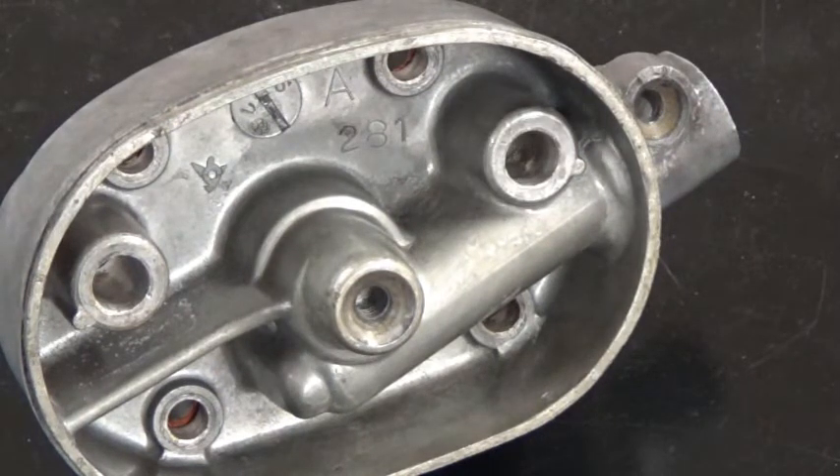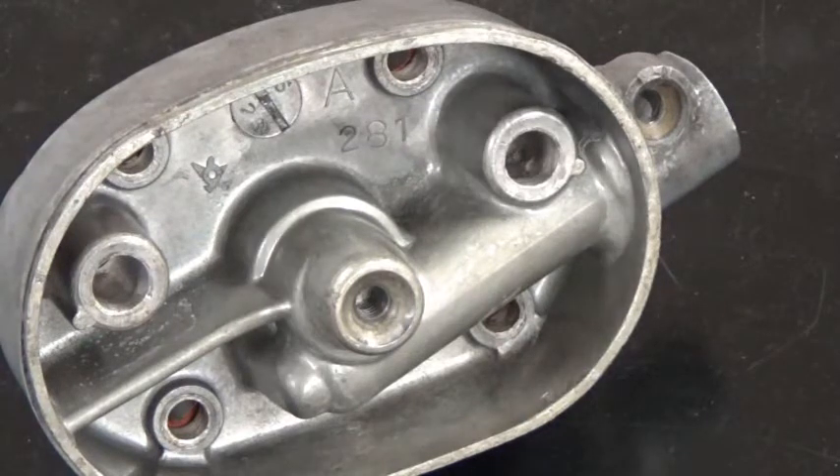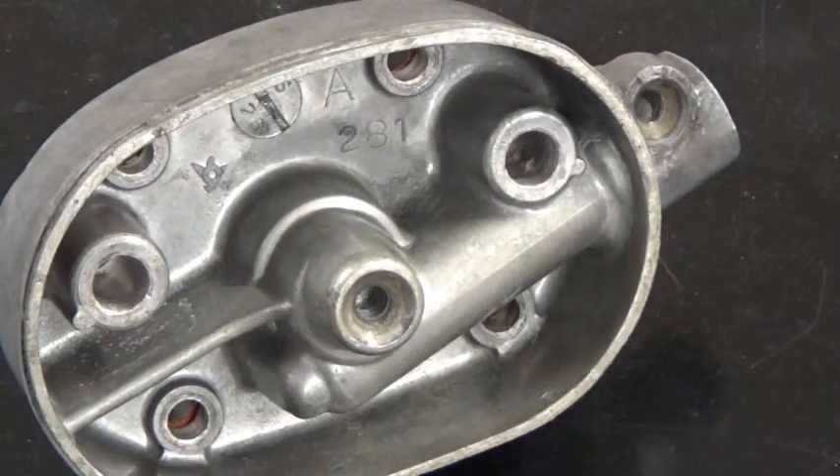We're not hard packing in that thread either. So you don't have to go back and chase the holes or re-thread the holes — they're perfectly fine. After they come out of the machine, after they're rinsed off with fresh water, after they're blown down with compressed air, the part can be sat on the shelf or the workbench for reassembly at a later date. So let's put this part in the machine and see what we can do with it.